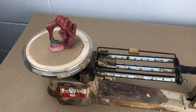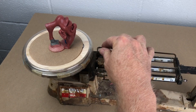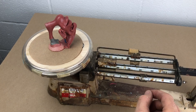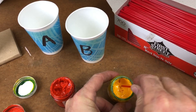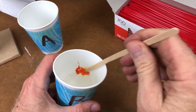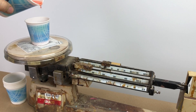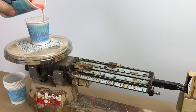I'm weighing the wax model to figure out how much resin I need for the first pour. The ratio of wax to resin is 1 to 0.8 — so a 100-gram wax model needs 80 grams of resin to fill the cavity. After the first casting, you'll know exactly how much resin it takes and can measure out precisely what you need. I put dye in the resin, but that's for video visibility — it's really hard to see white castings. Resin is a two-part system, A and B, equal parts by weight, not by volume. That is critical — you cannot measure this stuff by cups.